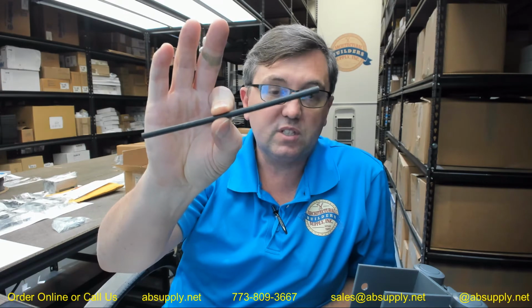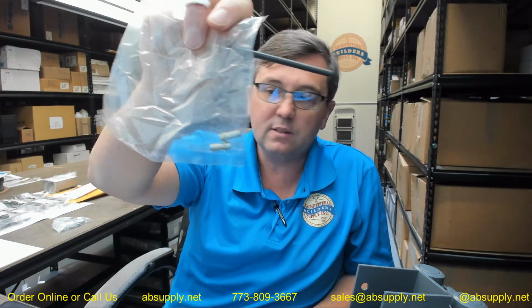And this is going to talk about how to set the tension on your opening. Caution, work safely, use proper safety protection when installing and tensioning spring hinges. There are really huge springs in here. That's a really big piece of steel that's there. That's the tension rod. And then again, your tension pins. For every order that you place, you'll get one tension rod for sure. For every hinge that you order, you'll get and require two tension pins.